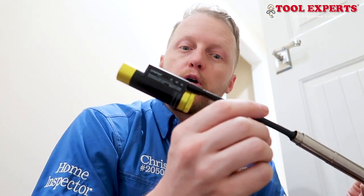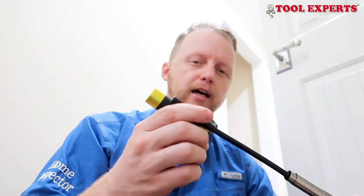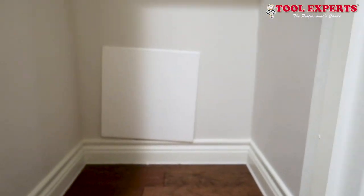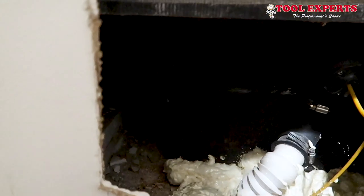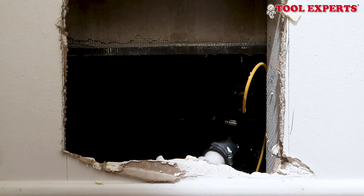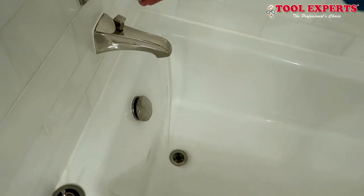Made it to the property. A small correction with the attachments — you don't need another attachment for this attachment to connect to the ferret camera; it all links up together. So we're going to use the extension pole with the ferret camera and check out this plumbing hatch. One inspector was wondering if the tub was leaking back here. You can see they've done some home modifications behind the tub. We're going to run the tub water and stick the ferret camera back there to check for water leaks, any type of damage, and see how the low-light camera works.